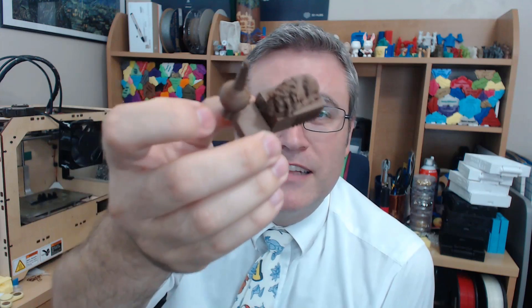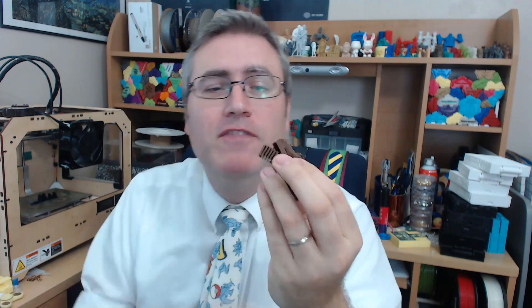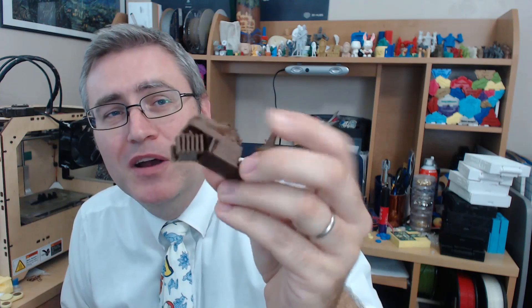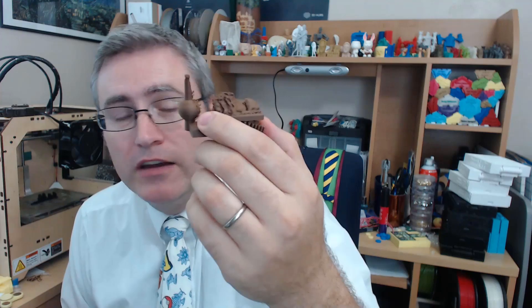Then I printed with cork fill, using essentially the same G-code and temperature settings, and it is a magnificent print. Look at that top layer — there's nothing supporting it but a couple of top layers. Generally speaking, do increase your top layers, but this is a beautiful looking print. The supports still don't remove great — they took the bottom with them — but cork fill is the best printing of the lot.